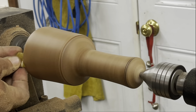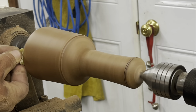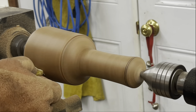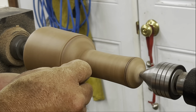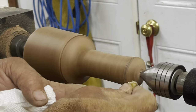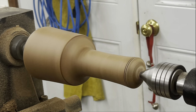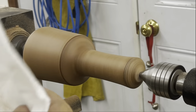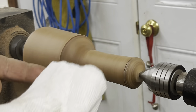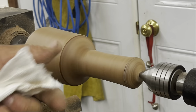And if you know a guy like I do, you get your beeswax from a live working beehive, and it smells a bit like honey. Okay, I've got a good coat of beeswax on there now. Okay, now you use your paper towel. And this is why it's dangerous. If you use cloth to do this, the cloth can get wrapped up in the wood lathe, and cloth doesn't break. It tears very difficultly, whereas a paper towel rips pretty easy.